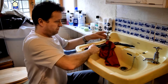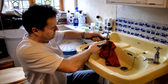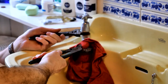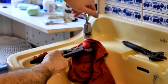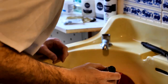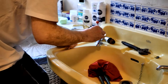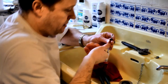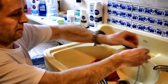I've got a fantastic grip with my pump pliers. Adjust my shifting spanner, hold against myself, make sure the tap's not moving anywhere — and I like that, it came away nice and easy. Undo the tap, take the body off, and carefully lift it away. What we see is we've actually got no tap washer left in this at all. The tap washer is almost completely gone, and it's just floating on the water in here. There we go — the remnants of the tap washer. When it was operational these two bits were drawn together, and it's now long since defunct.